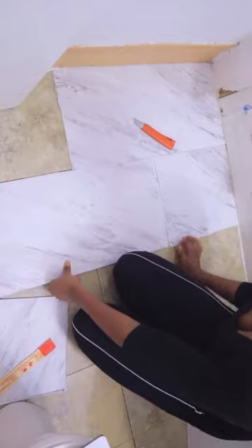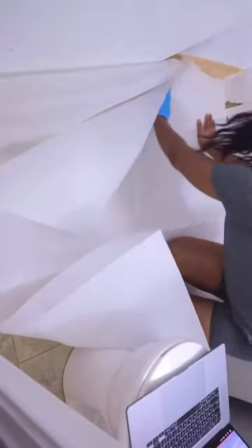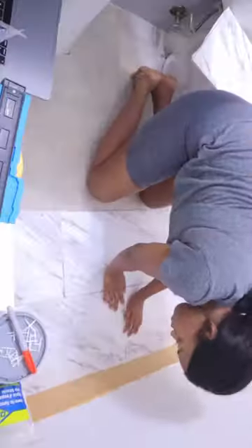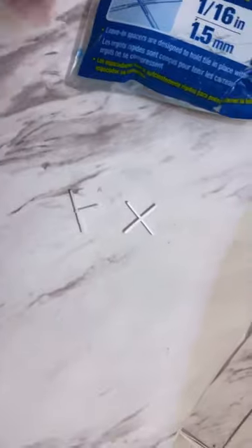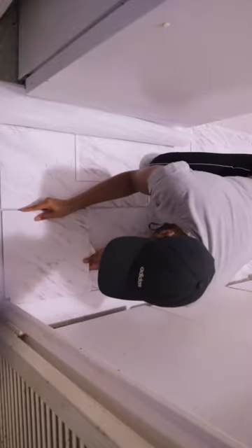Once you have your half, place it down underneath your larger tile, then grab another large tile and dry fit the whole bathroom. Now, the thing that's going to save all renters is putting down this barrier. Once you put down the barrier, dry fit one last time, make sure everything's correct, and use your spacers — I cut my spacer into a third instead of a fourth so they sit properly between the tiles.